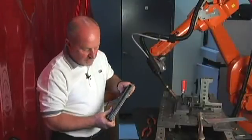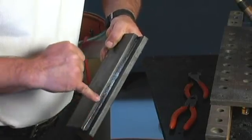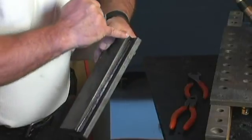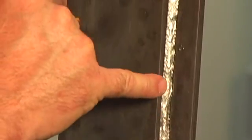Here we have the samples for the half-inch steel. You can see the programmed point at the beginning, how we tracked along to the end where the gap has opened up to 4mm, and we've successfully tracked the whole length of the weld.